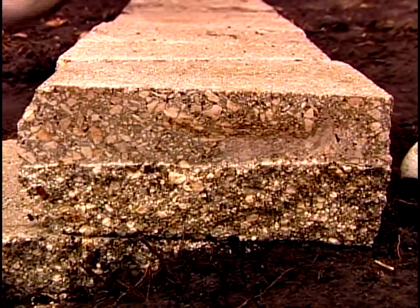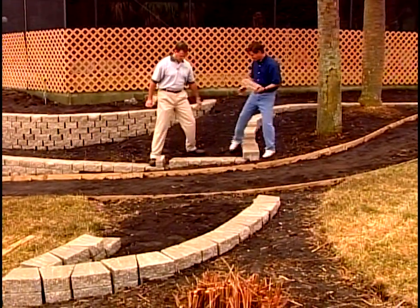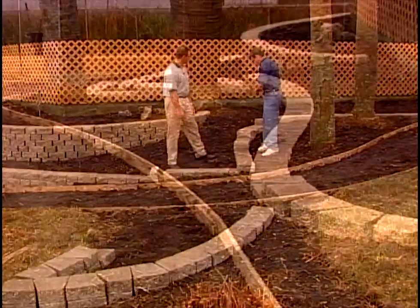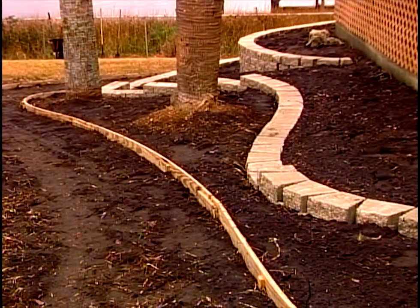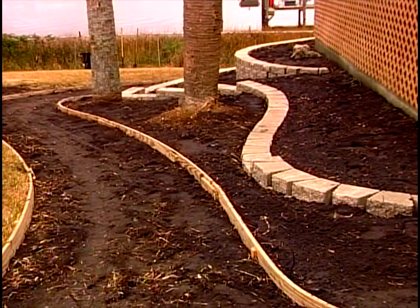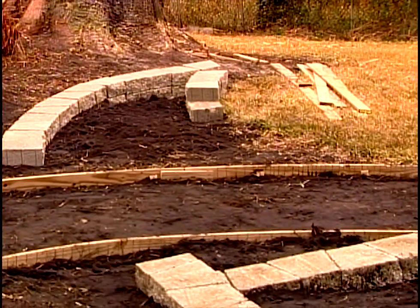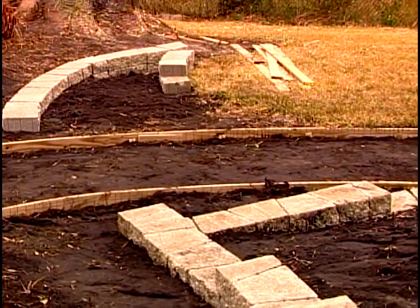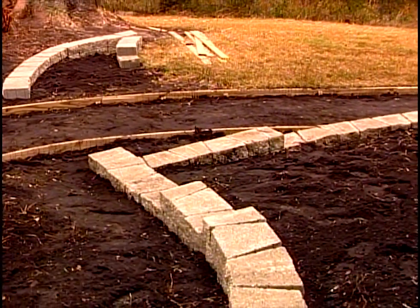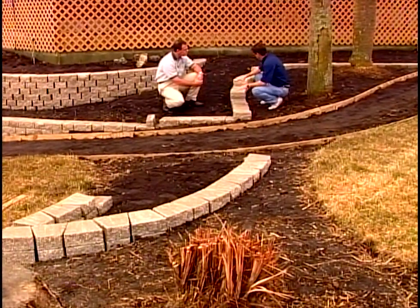So I thought it was interesting, again, that this same block is used to turn the corners underneath, or in this case, as we used them, to basically do some stair stepping. Your wall doesn't have to be at one level all the way. So we've taken advantage of the terrain or the grade here and kind of stepped it down. I don't know what you think about that. Absolutely, and that again is the single part system. Like you said, it makes the capstone and it also makes the nice cornerstones. If you split them directly in half like you did, and you said they split very easily, that's precisely what the block is designed to do. You can make some nice radius corners right here, a perfect 90 degrees by alternating the corners. Now, we're thinking also of maybe bumping this up one more block.